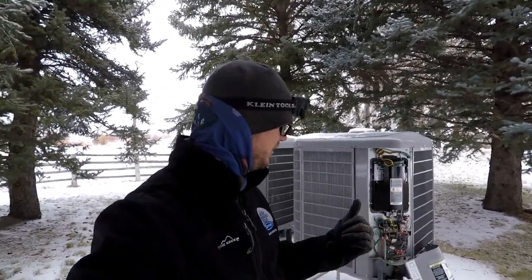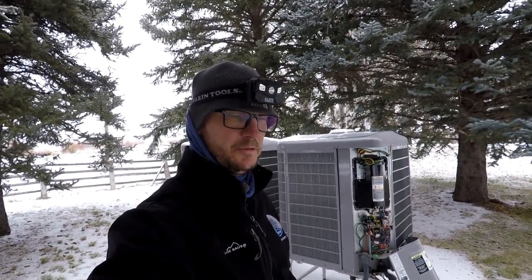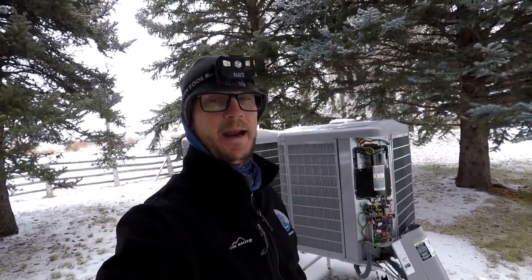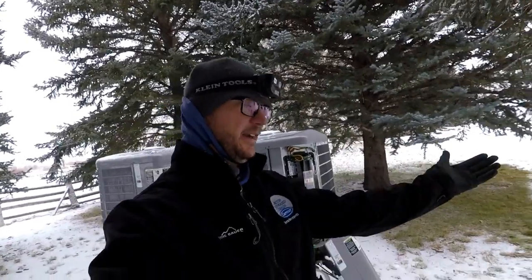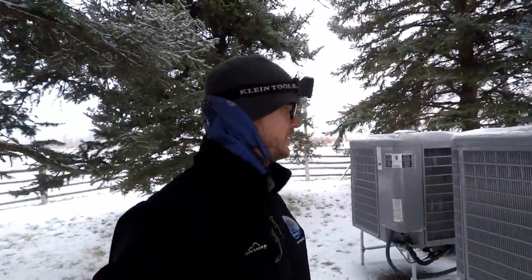And just my last video, I was working on a rooftop unit, and I was just trying to clean the flame sensor, and I was literally ripping my hair out trying to get to this flame sensor, because it was in this tight little space you got to go back into. But you pull one screw out and remove one panel, and it opens up everything to a huge wide open space over towards the condenser on that unit. And I just forgot about it, and I just spun my wheels and got frustrated and all that after doing this for 20 years. And I've pulled a few of those plates, not a lot, but enough that I should have known, I should have remembered. So it happens, man. It happens to anybody. It happens to everybody. So that's just part of life.